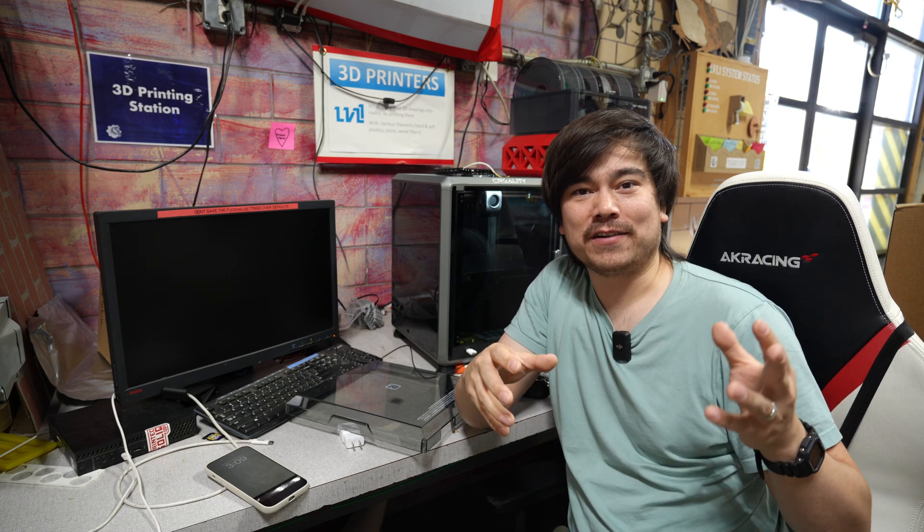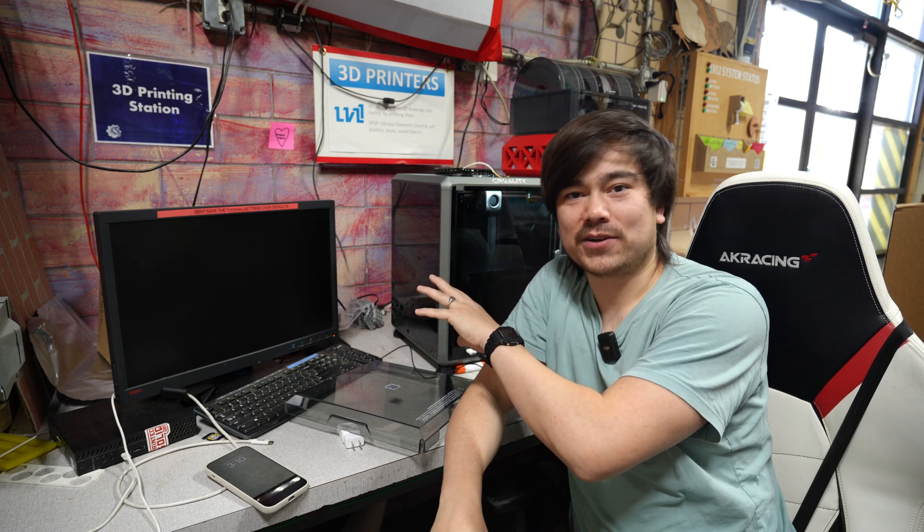So that just goes to show that although my shop looks dirty, it's actually quite clean in terms of air quality and the amount of dust. If you have something like a HEPA filter that's helping draw particulate matter out of the air, that should help prevent these types of clogs in addition to the other air quality benefits. It'll help get rid of those ultra-fine particles that 3D printers can emit and also improve your print reliability — something I never thought it would do. So thanks for watching this episode of Nathan Builds Robots — make sure to keep your filament clean and keep your 3D printers running. I'll see you in the next episode.